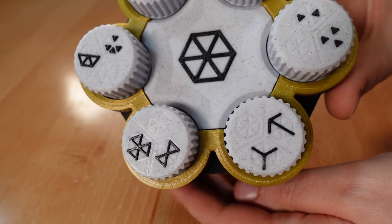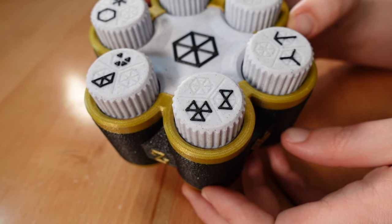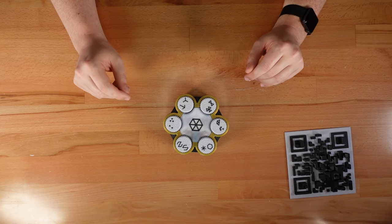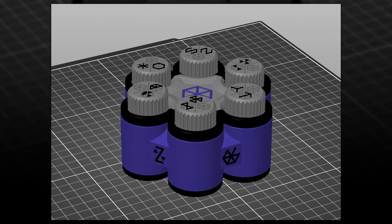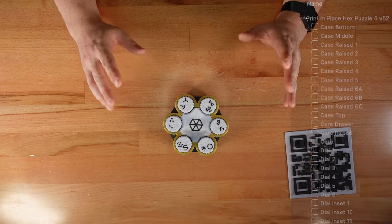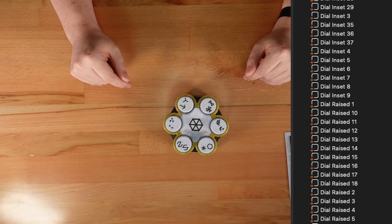My copy of the puzzle box includes a few elements that are printed in different colors. This isn't necessary for the puzzle solution, although it does make solving the puzzle easier on the eyes. If you're printing this on a single color printer, I recommend using a light filament color, so surface decorations are easier to read. And if you're printing this on a multicolor printer, use high contrast color schemes. An onyx box with charcoal highlights won't be fun to solve. When applying colors to the model, you might find part names added to the 3MF file. Don't worry about reading these. The names are sufficiently vague to avoid spoiling the puzzle solution.